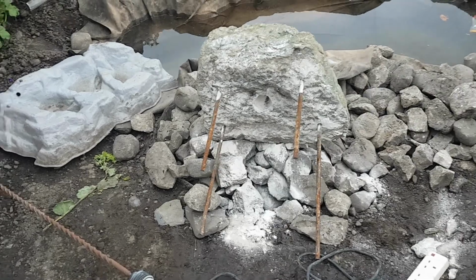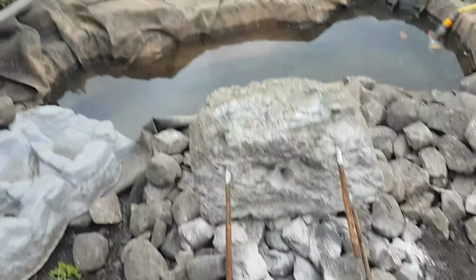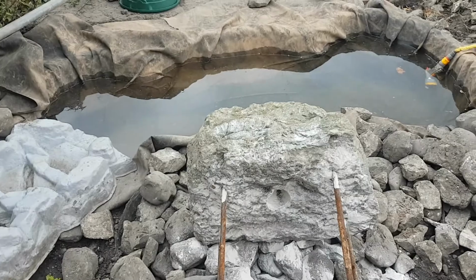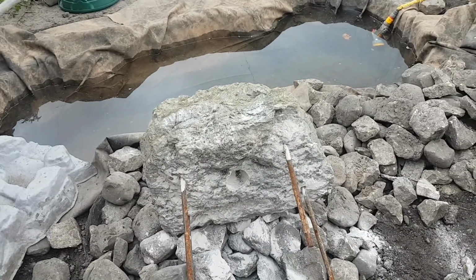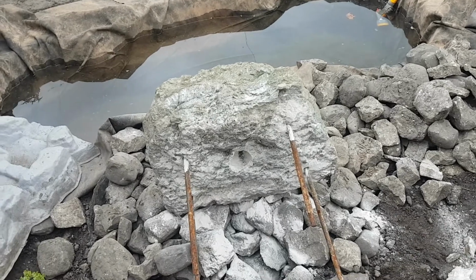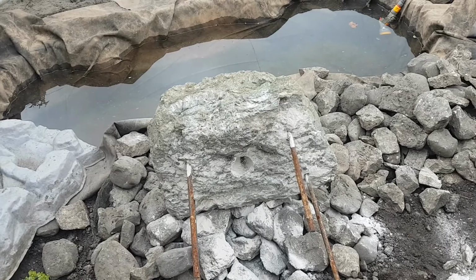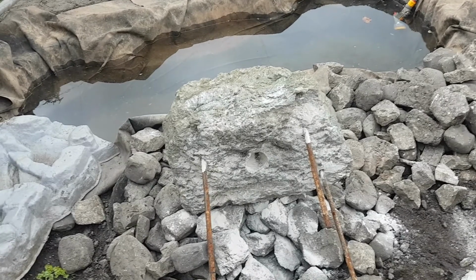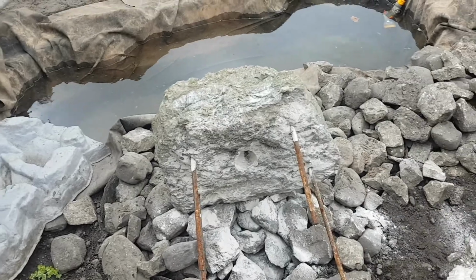So now you can see how I'm going to basically attach it. That box will go between them and they'll reinforce back into it, so that stone can't fall forwards or backwards. It can only move literally horizontal. In fact, I think I've drilled the bars so they're all at slight angles, so that way there is no one movement that it can make and get itself free without pinching somewhere or other.